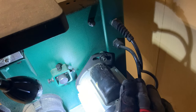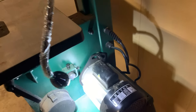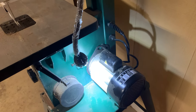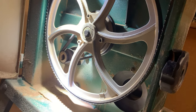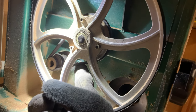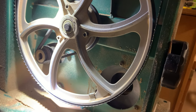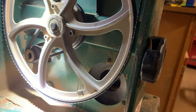You have to loosen those bolts in order to move the belt. When I checked these bolts they were already loose from the factory — a good bit loose. I moved the motor over to the right in order to get more tension on the belt, then tightened the bolts. The manual says there should be about three-eighths of an inch of slack in the belt once adjusted properly. When I made the adjustment, I could almost pinch the belt together between the two pulleys — that's how loose it was. That was the biggest issue from that last video and really probably the only cause of the power issue.